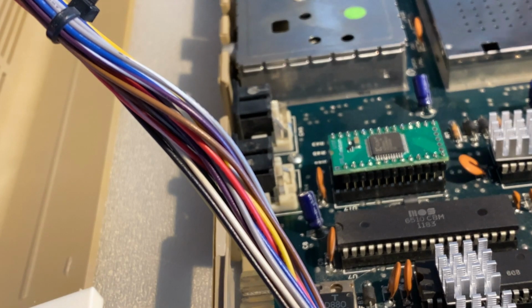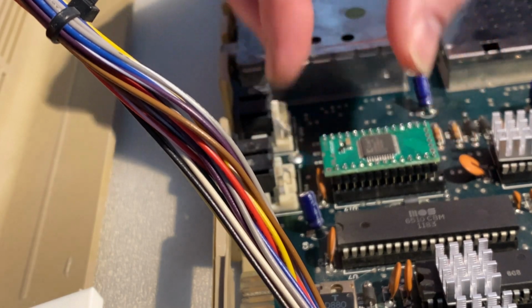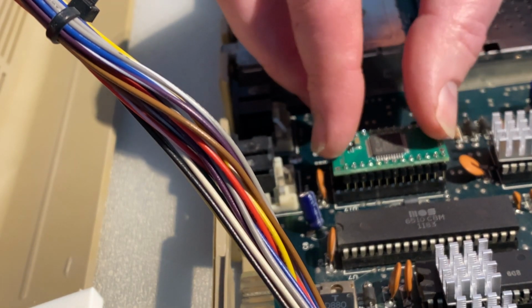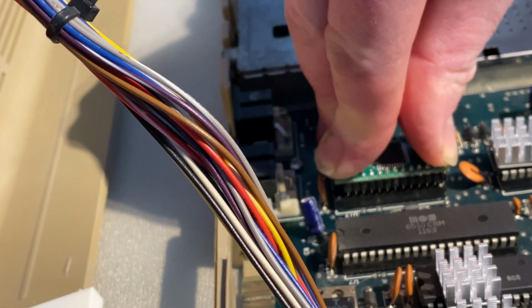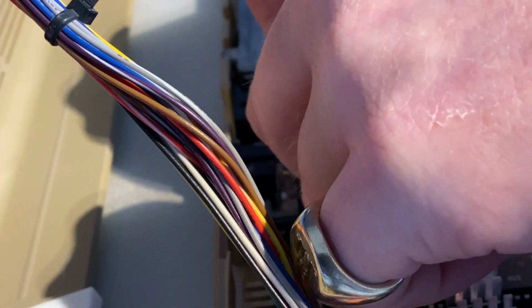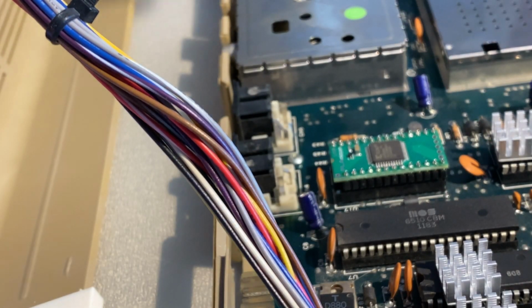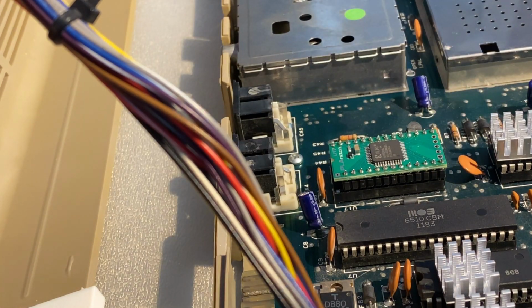Okay, if you look at the PLA, you'll notice that the top left-hand pin is not actually in the socket. So if you were trying to do it like that, you'd misalign it, you would overshoot. So you've got to go down one below it. So to push this in now, and it's tough, resisting a little bit. Maybe if I push it down together, there we go, we're in. We're missing the first pin down in here, so we're missing that first slot, but all the others should be plugged in correctly into the socket.